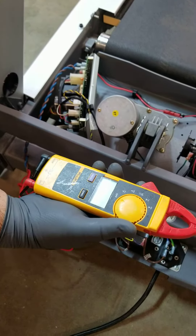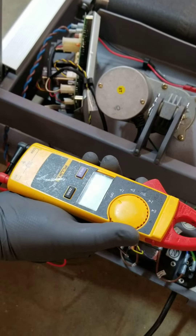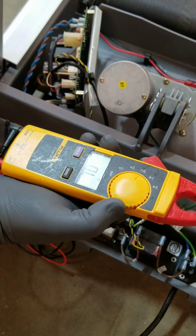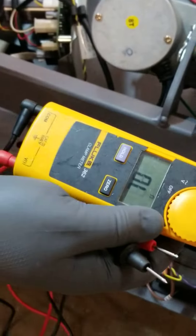What I'm going to do right now is use my meter to test for motor health — just test the continuity through the motor to make sure, if I've got a condition on this treadmill where the motor's not turning, whether I have a good treadmill motor or not. This is a very easy test.